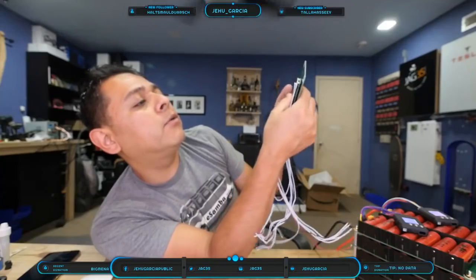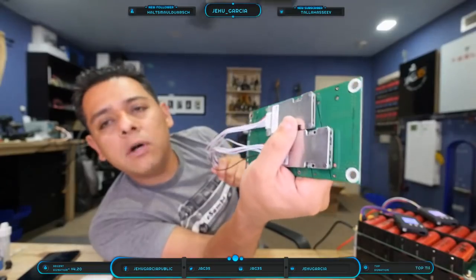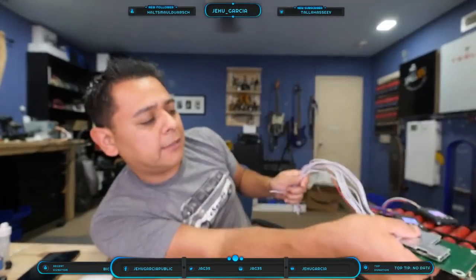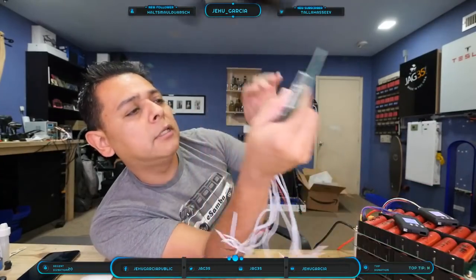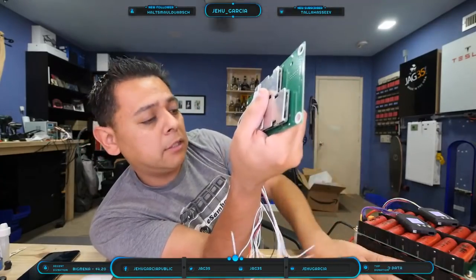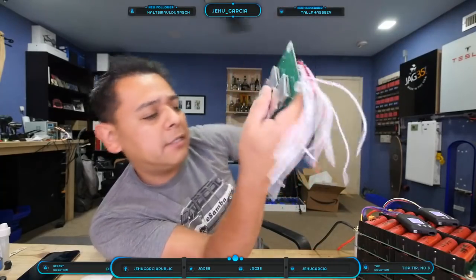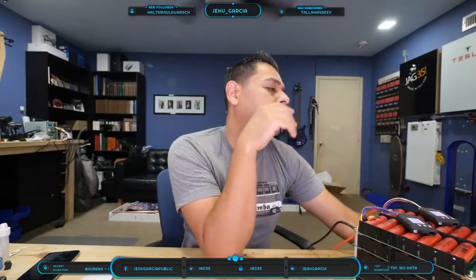BMSs. So that would be a quick way to have every 10 modules for about $12 have a BMS on it, right? So about every half a kilowatt, and it'll do 40 amps, right? Because 4 amps per module. This one will prevent you from pulling more than 40 amps on the 10 modules, and it'll be nice and safe, right? I mean, I don't know how safe these things are or whatever. But I'm working on that, and as soon as I finalize this, which is the main board version, then I can get to that other version.